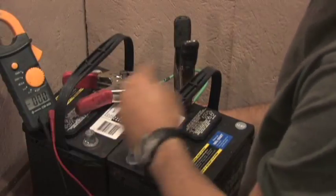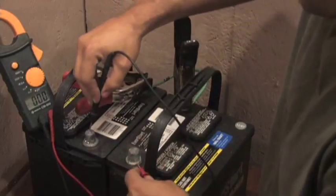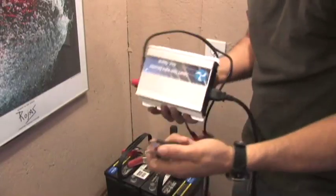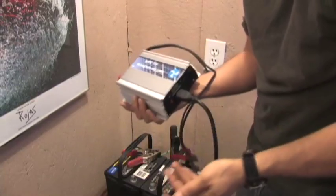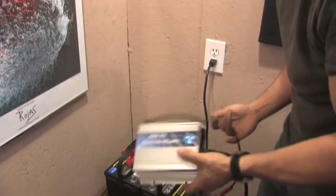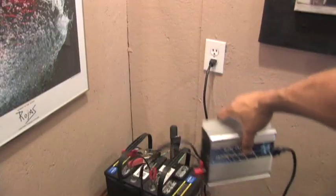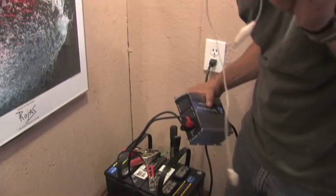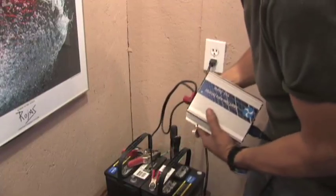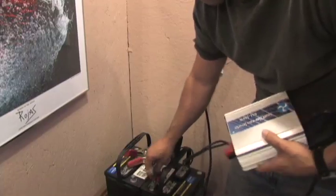What I have here is two 12-volt batteries hooked up in series. Remember, it doesn't work off 12 volts, so you have to step it up to 24 volts — you can see we're at 24 volts on the tester. So the first thing you do is take your AC outlet. Normally it would be a bad thing if AC current came out of here, but it can tell if there's anything hooked to it so you don't get shocked. This plugs into the wall just like a regular outlet and these connect to your battery terminals. You want to use really thick wiring — when I tested this I used a thin wire and it burned it right in half. These pull a pretty good amount of amps.